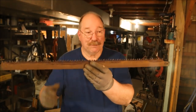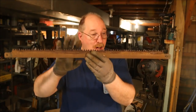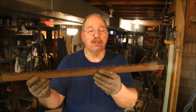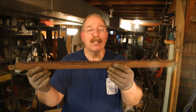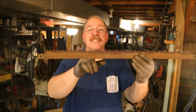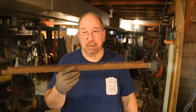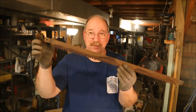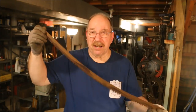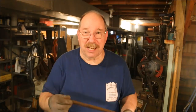I've sharpened this blade from one end to the other and it's able to cut on all these teeth — all these teeth other than the two short ones in there. The short ones are almost up to the point where they're cutting. That's one of the short ones right there. In this kind of saw, people tend to just cut up near the handle. They don't pull it back for a full stroke because out here it'll tend to buck and wobble. So they come up here and try to do a power stroke where they can really get after it.